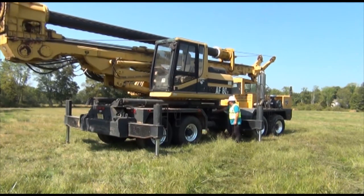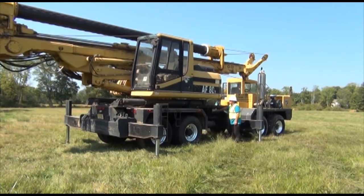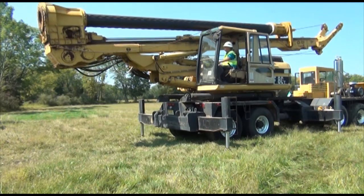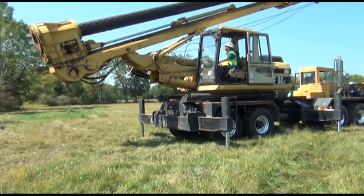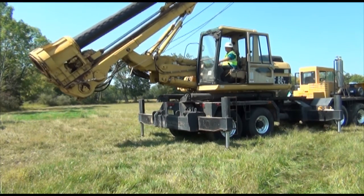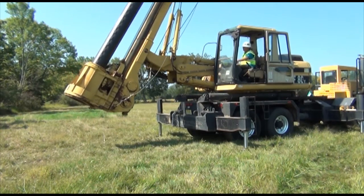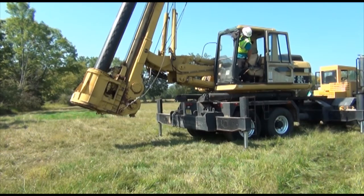And as you can see in the picture, I am setting up the drill rig on 4 jacks and sliding the 315 body back using the lower hydraulics in the truck. At this point, I get in the top of the cab, totally separate from the truck, and raise the mast up. Position the top head in order to put the clips on to hold the top head guide on the rails. This takes it out of the travel position down the road. The travel position is just under 13 foot 6.